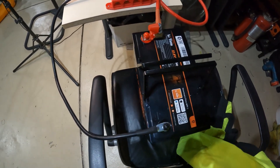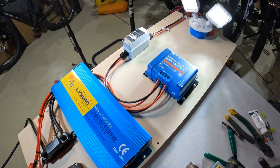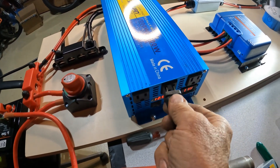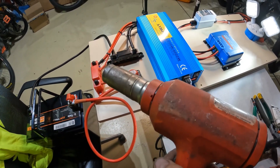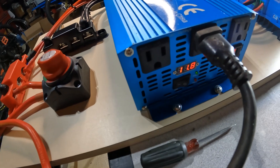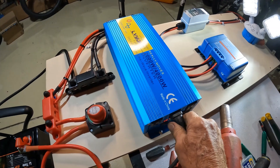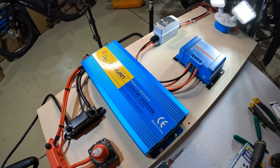I've just hooked the battery up. We're going to turn the power on at the main switch and see if everything comes to life. There we are — we've got the lights that light up the panel, the inverter has stabilized at 118 volts, and we've got 12.9 volts on the battery right now. I want to charge the battery up before running it hard, but I want to check that the inverter works first. With this high-amp-draw device as the test, it drops to 11.8 volts under load — and we're good. The inverter works. Just wanted to confirm that before mounting everything on the wall.